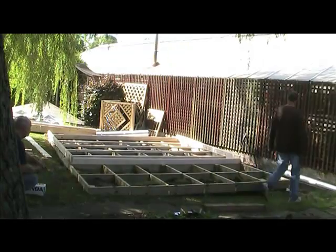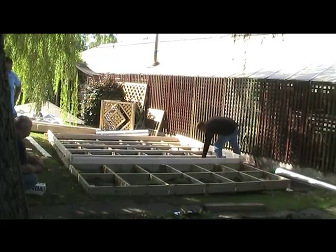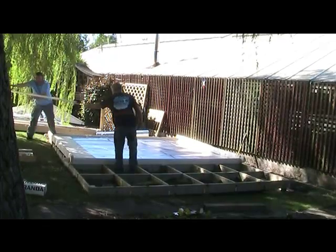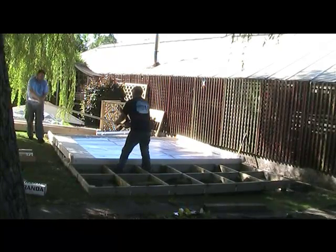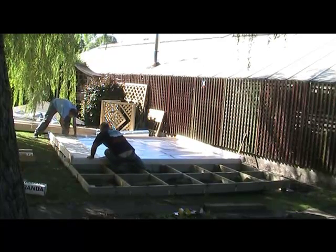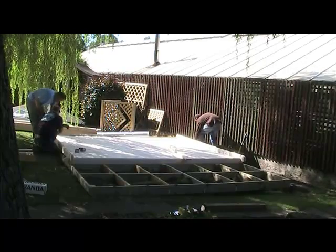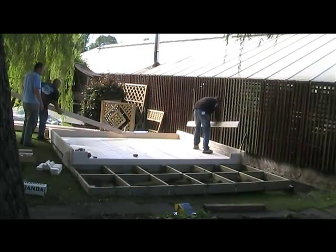The floors of our cabins are fitted with a 28mm board compared to the usual 19mm. However, we still recommend fitting a foil insulation. In this case, we use AirTech double insulation for extra warmth in winter. You can now start laying the floorboards.